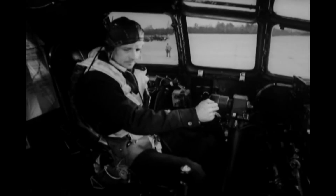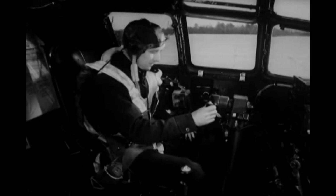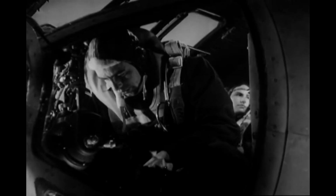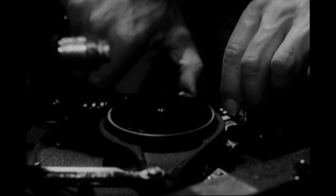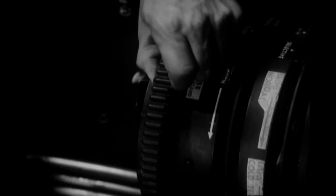Next, you want the bombardier. You know he sits back with the navigator and the radio operator until the ship is in the air. But right now, he has to come forward to make the final checks on the bomb sight. He's already completed the regular pre-flight inspection of his equipment. All he must do now is see that the bomb sight is entirely ready for takeoff. The directional clutch should be disengaged and the secondary clutch engaged by turning it clockwise. Then the drum wheel must be turned counterclockwise as far as it will go. That does it. He's all set to take off.